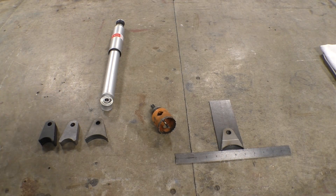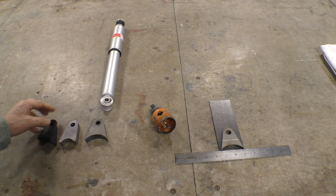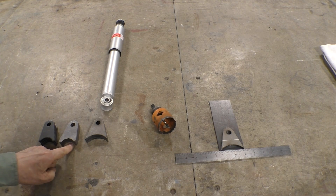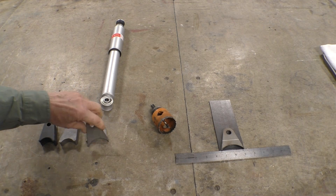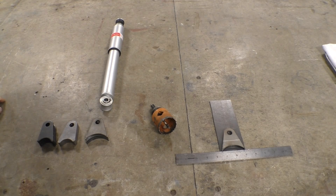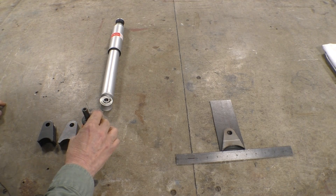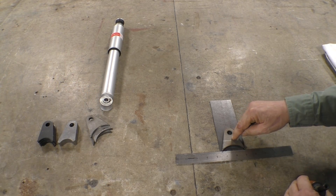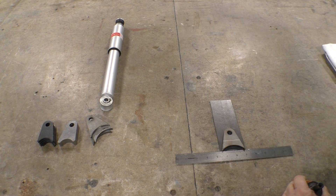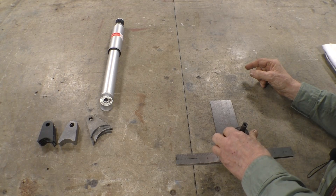I have ordered three different sets of weld-on tabs for the axle and none of them work. These are slanted for some reason — they're not made to go straight up from the axle and they're for an inch-and-three-quarters axle tube, so I can't use them. This one is for a three-inch tube but it's straight up and down, so I can't use any of those. What I've decided to do is modify this set so that it will work on our axle — I need to get a two-inch hole in there, but how do you do that when there's no guide for the guide drill? I'll weld this tab to a piece of square metal that I can put in the drill press and have a pilot hole to drill my two-inch hole.